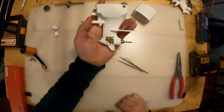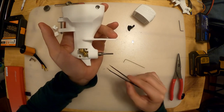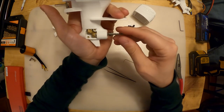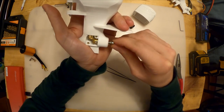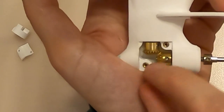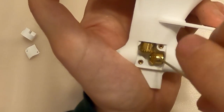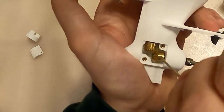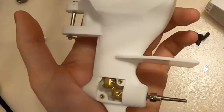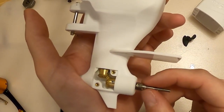Right off the bat I can tell the shaft is sticking out way too far, so I've got to pull this back. It should be basically flush with the end. I'm going to tighten the set screw against the flat just to start with, so it stays in place. See how the dog gear is pretty far away - that's why we have that longer 8mm flat, so we can adjust it to wherever we need.